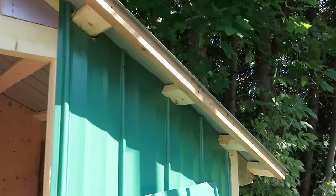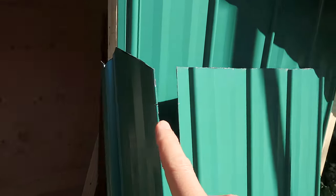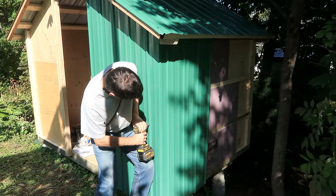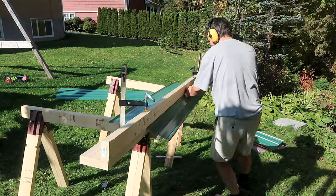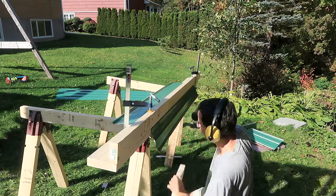I've got no soffits on the roof line, which means I have to fit the sheet metal around these bits here, and especially this corner — this is where it gets complicated, resulting in a part that looks quite complex, which is clever but not wise because it takes forever to make. And again, using my improvised sheet metal brake to bend the sheet metal to fit around the back corner of the shed.